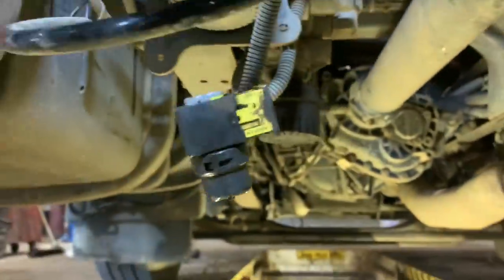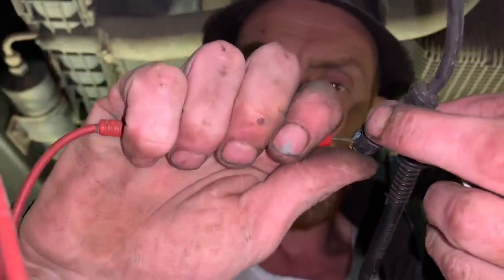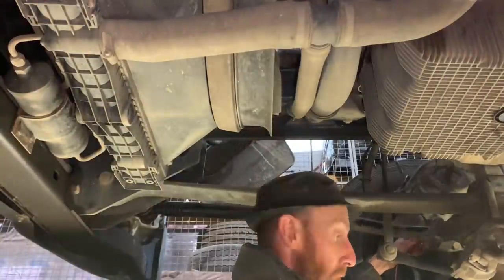I'm going to put a bit of wire in there and test to see if I can get continuity between them. That's in number one, so then we go to the front here where the sensor is. Put the multimeter on — yeah, beep beep beep. It goes down to that well over there, yeah, that's all right. Try pin number two — nothing on that. Try the other side — nothing. Try pin number three — not pin number three. First one was pin number four what I tried, that got the signal. Number five, no signal.